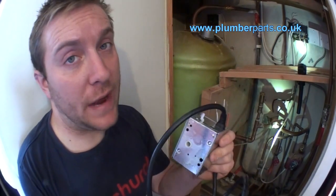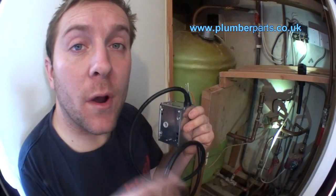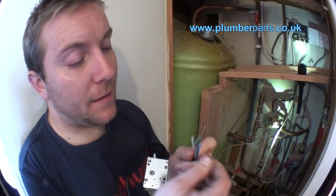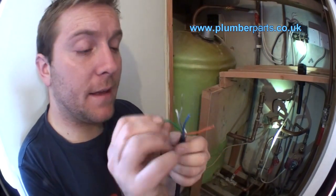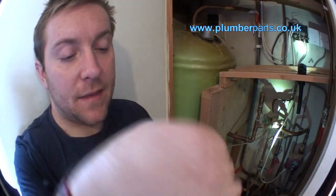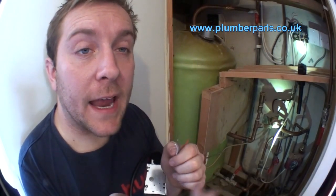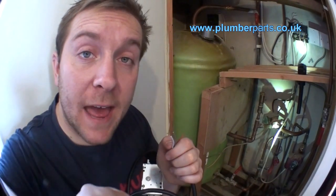Sometimes they can be confusing, the three-port valve type, because when it's only on heating, it has to have a separate live that keeps the boiler and the pump on. So what we have here — it's pretty simple. We have our standard wire here; this is our earth wire, that goes into the earth. This is our neutral. Now, these two here are our signal wires. On a two-port valve, you have a live, earth, and a neutral, and then a switch live and a switch down. When the two-port valve is livened up, the motor moves around, clicks the switch, and then it turns that switch live on back to the boiler and the pump.